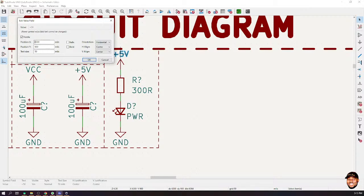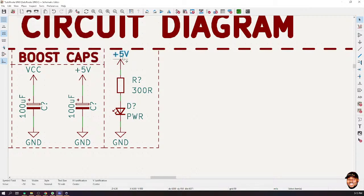When you change this, let's say I change this to 1 volt and increase it from there, 1 volt, 2 volt, 3 volt, in that order. You realize that before the LED completely turns on, the majority of the voltage will be dropping across the LED, not across the resistor, okay? Until the LED's voltage saturates, that is when you see that any increased voltage actively drops across the resistor instead of the LED. And it is a very interesting thing to see. Okay, so that is the reason we call this thing a protective resistor. Because the moment the LED reaches its saturation, any excess voltage, yes, the LED might change a little, but it is not as much as will drop across the resistor.